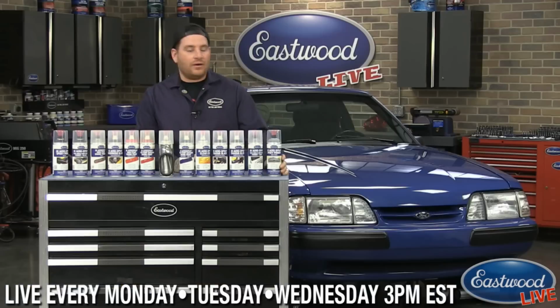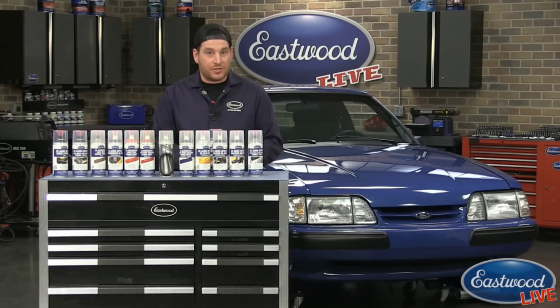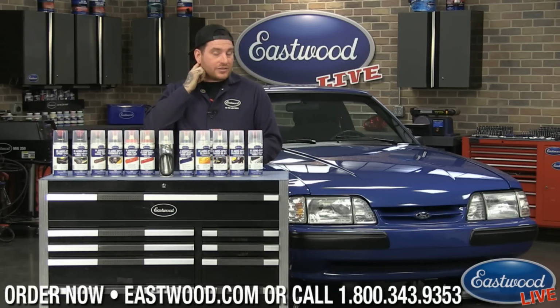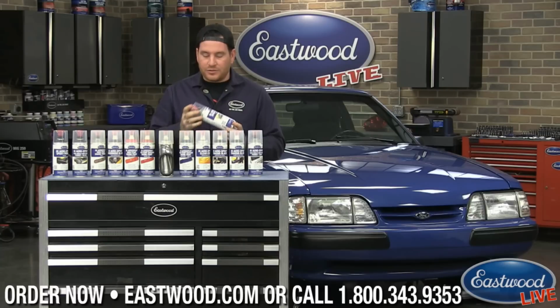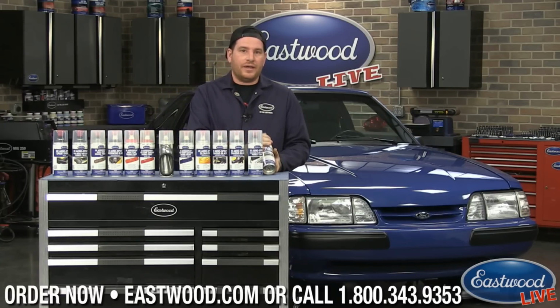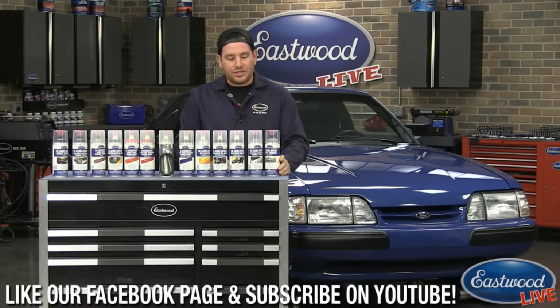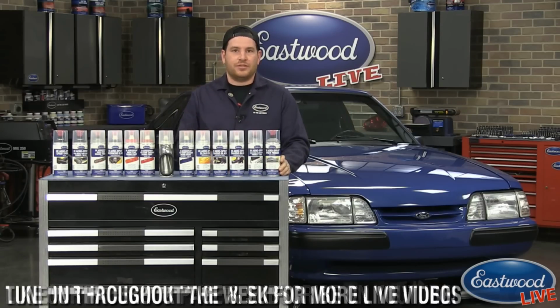Sure. So the pot life generally on these, you get 24 to 48 hours is common. It depends also on the temperature. A little tip you can do is if you keep this in a cool area after it's activated, you can get a little bit more life out of that. Generally, 24 to 48 hours is about it. You may be able to push it a little farther, again, depending on the humidity and the temperature in the area where you store it. But that's usually what I try to do.